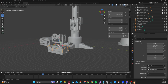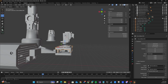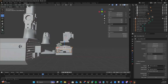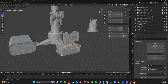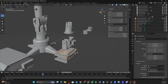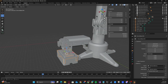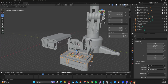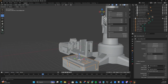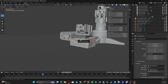After you screw this in, you're fine if you're using a regular attachment for your Raspberry Pi, like a fan that blows in air. I had to cut these little legs off from the inside, because I have an attachment with a full heatsink. Then of course you have to use three servo motors for the camera, and the camera goes right here in the front. I'm using the Pi Camera Noir 3, but you could use a separate one. I don't think it matters as long as it can see close range, because of the reach of the arm.